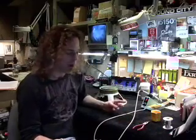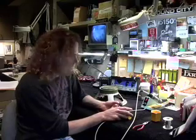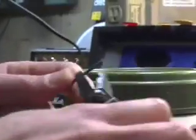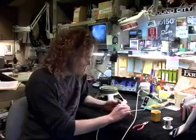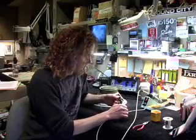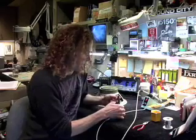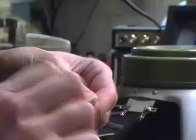The first thing you want to do is prep your wire. Take a clean wire with a clean cut on it and come back about a quarter inch to a half inch. In the needle section of the stripper you can see where it grips the wire — it doesn't cut the wire. So you come around it a half inch back and you don't pull it hard. Clamp down on it gently because all you want to do is strip the jacket off the wire. Then turn the wire, press it again, turn the wire, press it again, then pull the jacket off. Now you've got your wire exposed. Take your index finger and thumb and twist it so that it all lays tight against itself.